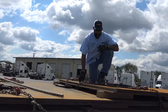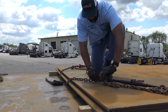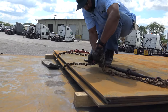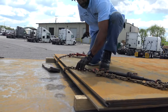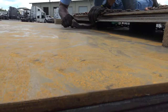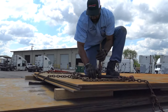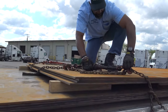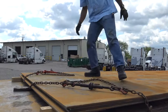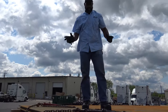When I pull my chain, this should pull up. I come on the other side to put my binder on just to make sure it's nice and snug before I start ratcheting it. I'll pull my chain tight and get a link. Now I won't lose my teardrop on each side. I'm going to look underneath and see where the chains meet, and I'm going to use a longer felt pad so the chains won't be touching. Now I've got my X-Chain on the top layer on the top and the front, and I'm going to repeat the same thing on the rear.